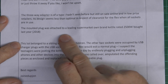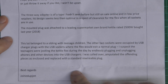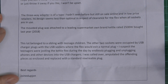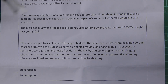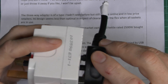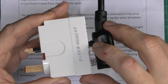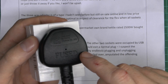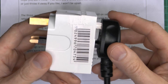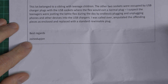The plug was attached to a kettle, 2.5kW, bought last year. The sender believes that jostling of the flex during the day and unplugging of other devices has basically left some kind of loose connection occurring there, and hence we've now got this horrible melted mess. We can just about see inside that there is a certain amount of plastic melting on the pin on this side. That's going to be the line pin, so that myth about it always being the neutral clearly isn't true. This comes from joined-up John.